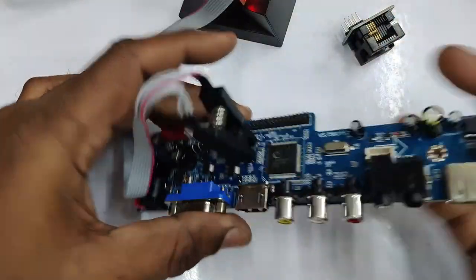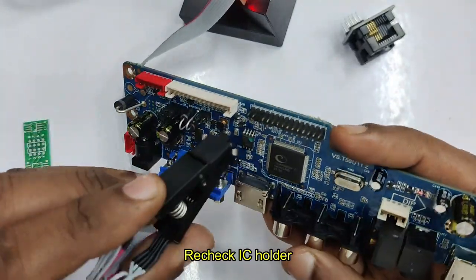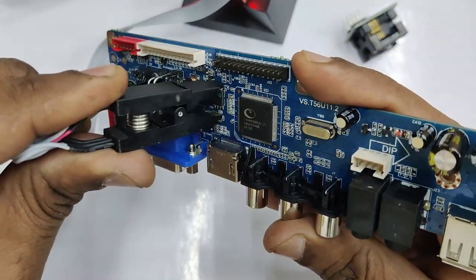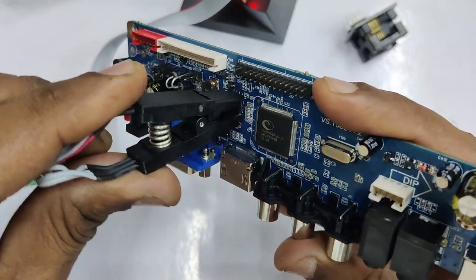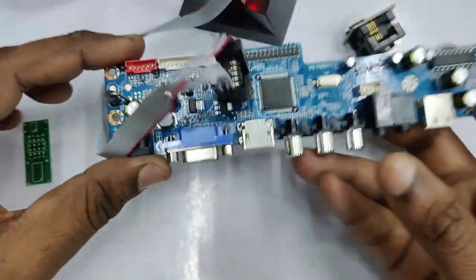Remove the clip and place it properly. Recheck the IC holder so that it holds the IC securely, and ensure that pin 1 — the red wire of the clip — matches the dot of the IC. Place it properly, otherwise you cannot read the chip.